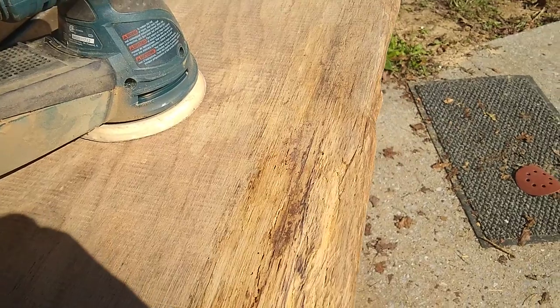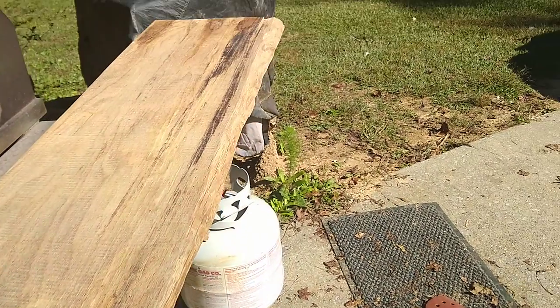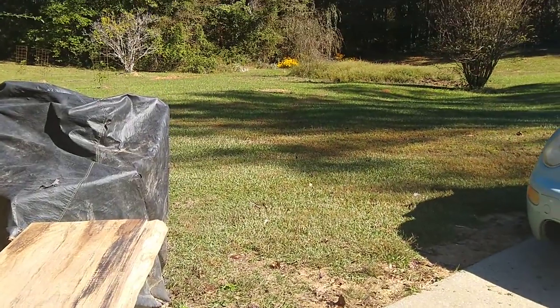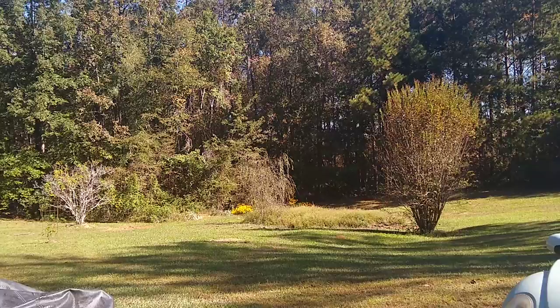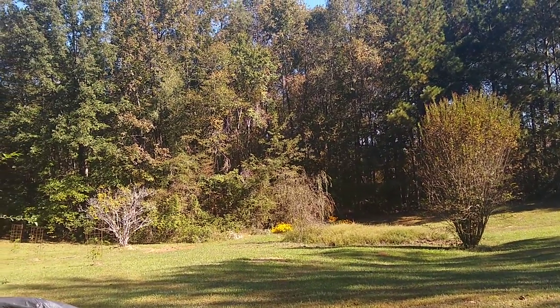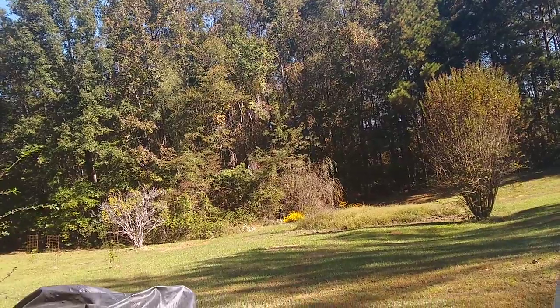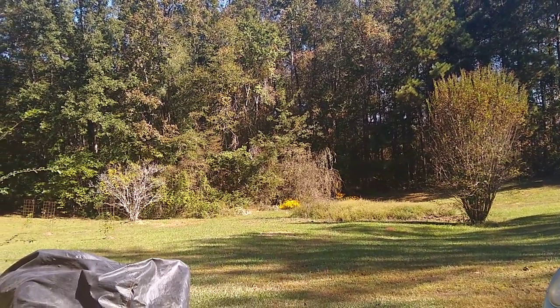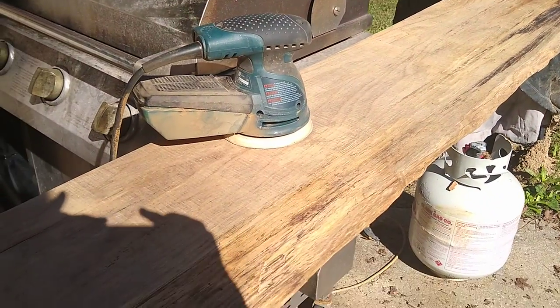I think I have some Kona, which is what I used on my floors, and my cabinets are walnut so they're dark anyway. I'm going to mix some dark stain and then dilute it with a lot of water, and I'm going to wipe it on quickly and wipe it off, just so it blends with the wood that I already have in my house.